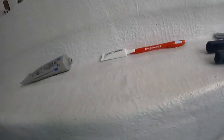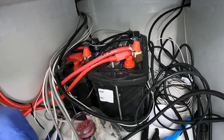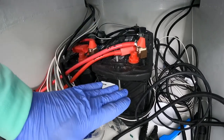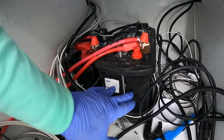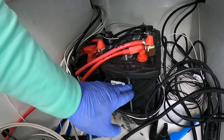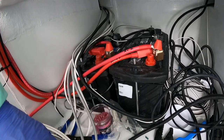If we were wiring in parallel, which is what we do for house batteries and the starting battery, we go positive to positive, negative to negative — that keeps the voltage the same at 12 volts but doubles the amp hours to give us more run time. So if both batteries were 100 amp hours, we would have 200 amp hours by wiring them in parallel.